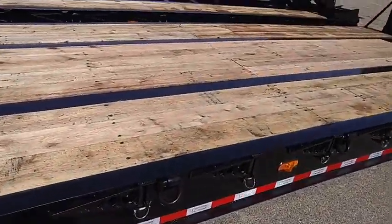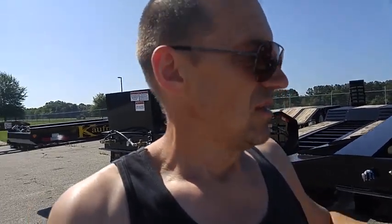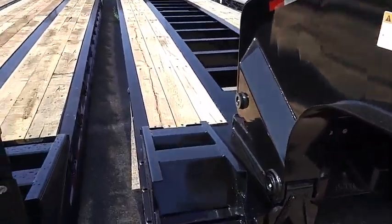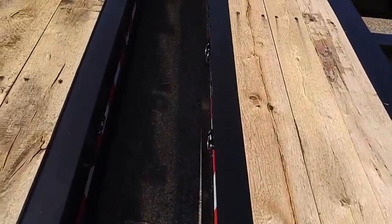So I can see they changed the d-ring design. You can get these trailers in pretty much any capacity — 35 ton, 50, 55 — and I got the 55-ton even though I never haul over 90,000 pounds, which is 45 tons. I wanted an extra cushion, to have a trailer that's a bit stronger so you're not maxing out the capacity. By the way, they're not paying me — this is not a sponsored video. I just like the product. It has its limitations but it's cheap, works well, and is pretty good quality. The d-ring design change is a real major thing for me because I deal with it every time.